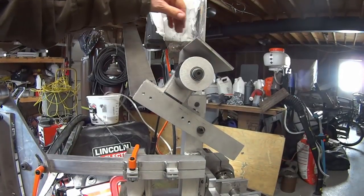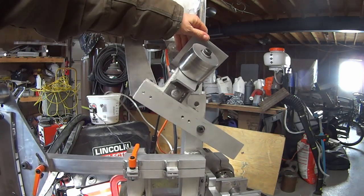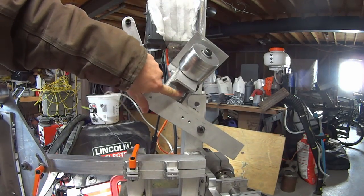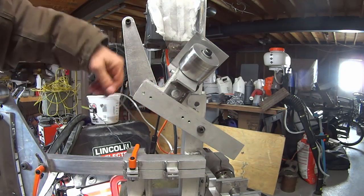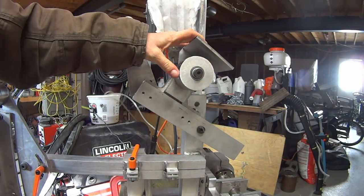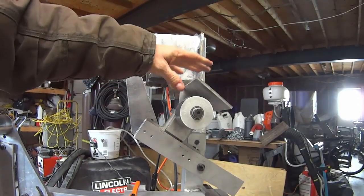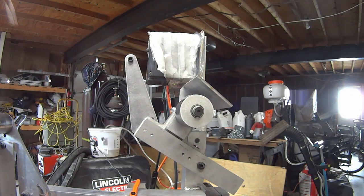The tracking system is not rocket science. It's got a little Teflon nylon-footed tracking adjuster that pushes this in and out — really a simple thing. This is a guard, and this is a belt catcher in case the belt breaks so it doesn't come around. One of the things about my grinding: I don't grind when going at high speed standing in front of the blade — I stand to the side because I use a jig.